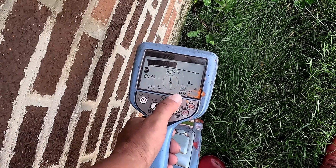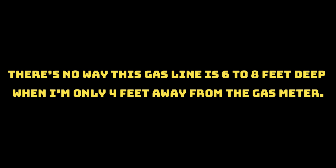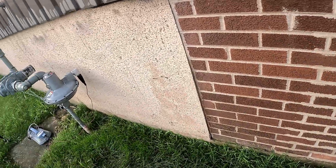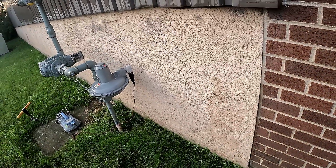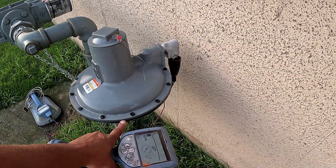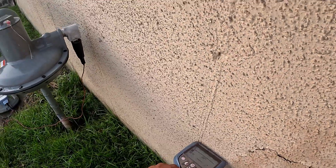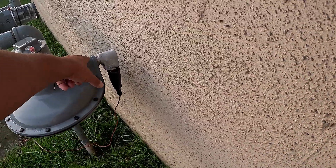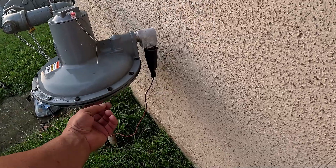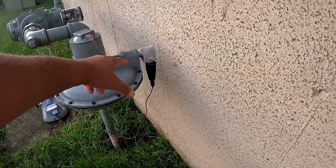82 milliamps — but look where I'm at: eight feet. Good milliamps, really good milliamps. But look at where I'm hooked up — I'm on an insulator. Like I said, this diaphragm right here is some kind of plastic or rubber material. Here's my vent — I'm above this gasket, I'm not below it where the service is. I'm above it on this blowout vent.